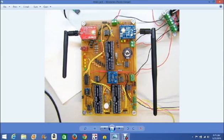This board communicates with the other circuit board through that connector right there. This connector is wired to this processor for programming it, but I also use the ports on this connector to communicate with the other circuit board, the timer regulator board. I'm not going to get too deep into this video because I want to just lightly talk about it, and then in subsequent videos I'll give more detail about different sections.